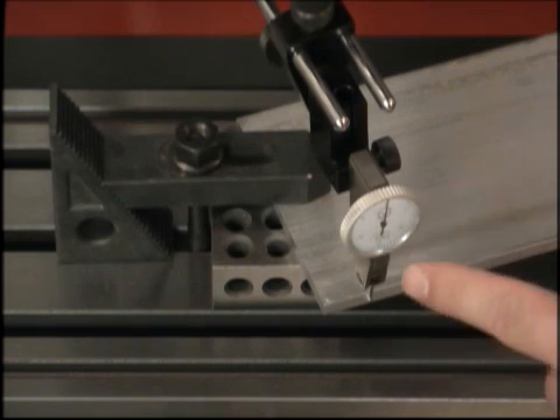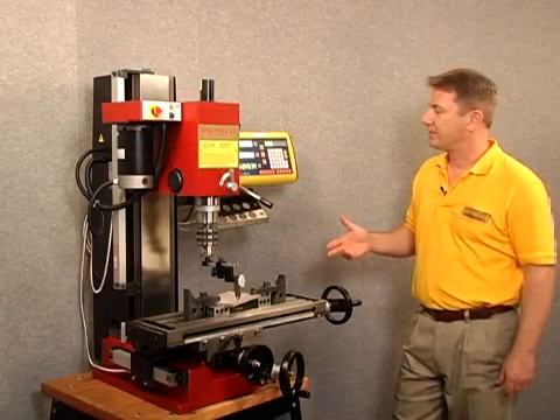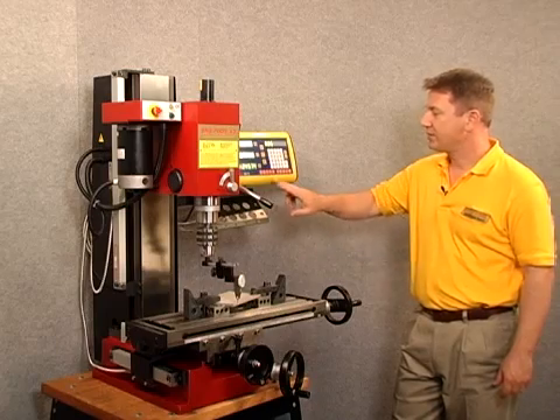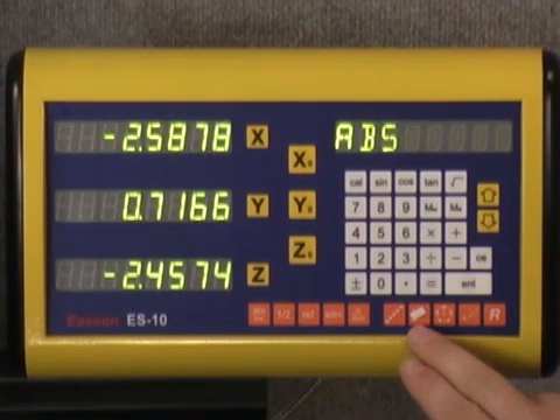You can see I'm touching the workpiece here and my dial indicator is zeroed at the top. Next we have to go to our display and locate the incline tool position button. That is on the lower right and it has a block that's canted or angled, so we'll go ahead and push that.